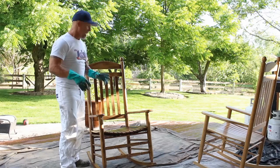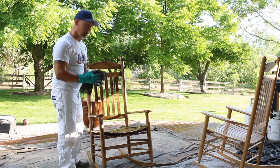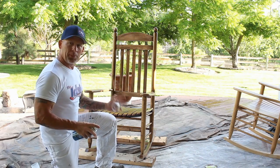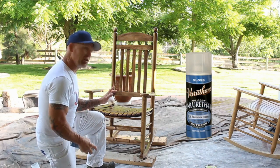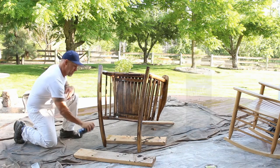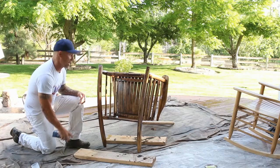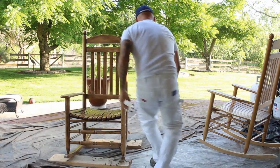I've got this chair all glazed exactly the way I want it now. I'm going to clean up my tools and let it set for about a half hour to an hour before I clear coat it. I'm going to clear coat it with a Helmsman water-based urethane in a spray can, which is very simple to use. It's been about an hour — the glaze is plenty dry. I'm spraying the rockers first, letting it dry for about 15 minutes, then setting it on boards to spray the rest. Just about got the thing all clear coated — that will be my final step.